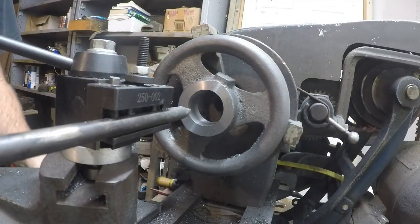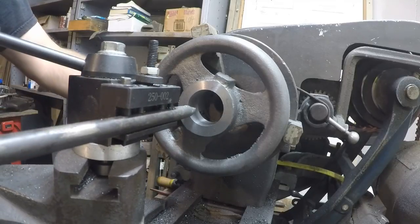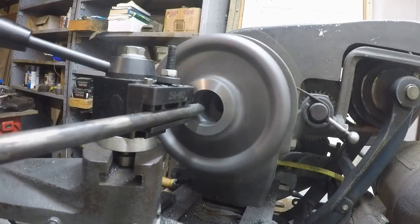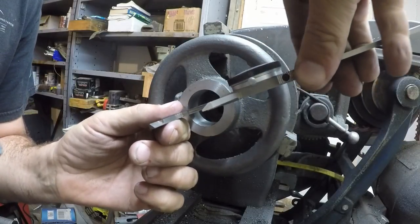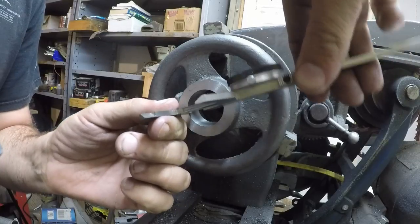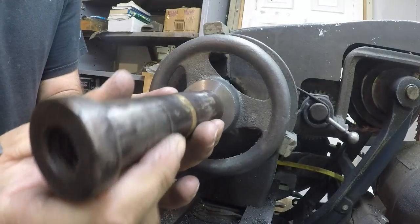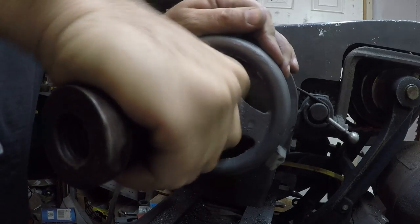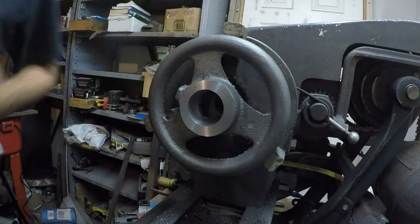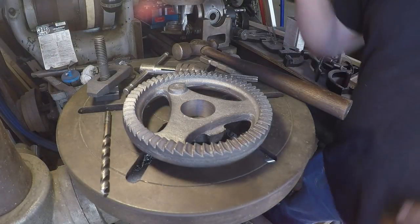Let's take a little more. Only showing about eight-thousandths left, so I'm going to dial in to cut six and see how close that is. It's showing two-thousandths away from the mark. Let's see what the part tells us — it's starting, but we're going to need at least that two-thousandths.